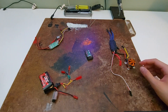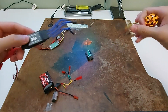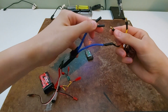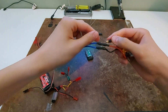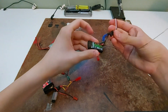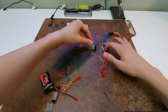Assembly is pretty simple once you have all the parts. I'm going to start off with my brushless motor and ESC. The ESC has A, B, and C wires, while the motor has colored wires. I'm going to put the black wire to A, the red wire to B, and the yellow wire to C. And the brushless motor is all wired up. Now I'll connect it to channel 3 on my receiver, making sure that the signal wire is in the correct spot. And I'm all good there.